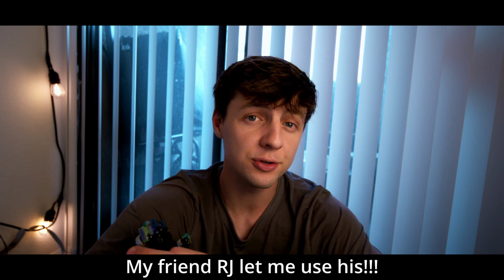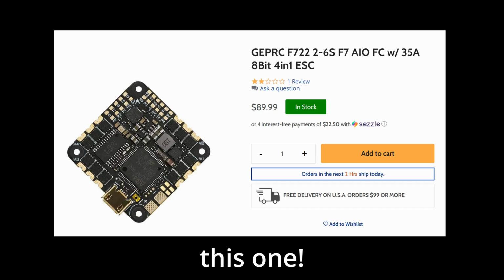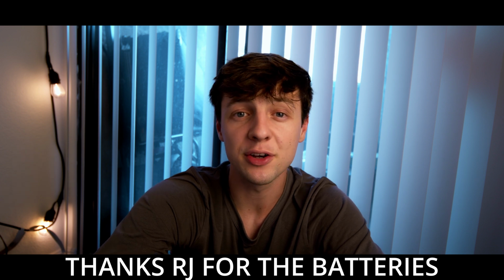This is the board that Flyfish sent me with the frame, but I actually ended up swapping it out because the only 4S batteries that I had access to had an XT30 connector, and that board doesn't allow you to use an XT30 connector. So I ended up using a spare GetBar-C AIO, which allowed XT30, just so I didn't have to break the bank buying new batteries.